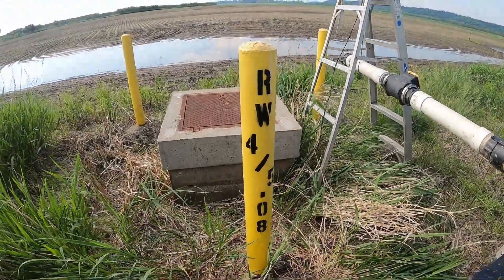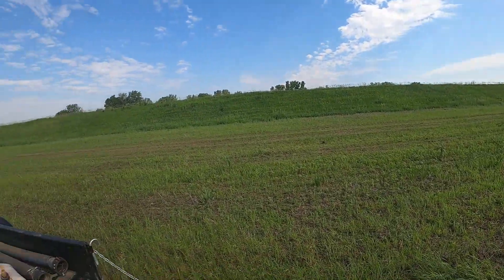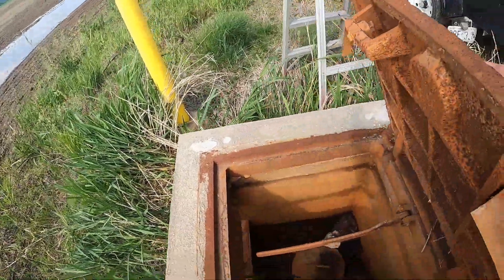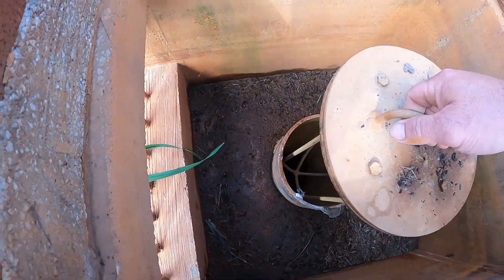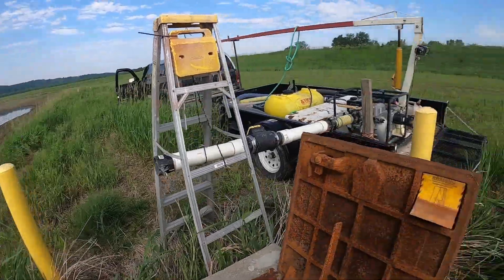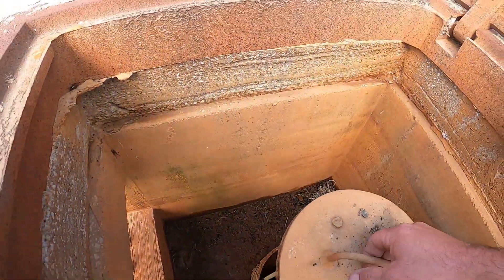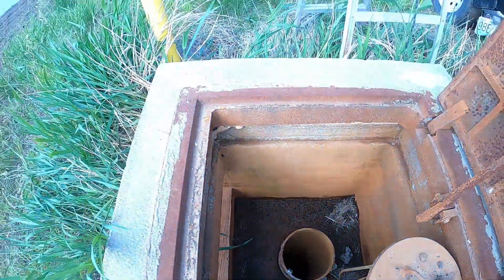There's what's called relief wells. I'm sure you've probably seen them — there's tons of them down through here. I don't know how well you can see them, but we've got 30 or 40 right here on this bend of the river where the levee makes a big corner. What each one of these things does — you open this up and you have a well that sets down in here. As water raises on the inside of the levee it builds pressure, and instead of undermining underneath the levee and finding the weakest spot to get out, they have these wells all drilled so that as the pressure comes up these lids will push up and it lets water come up out of these holes, which are wells usually somewhere between 30 and 50 feet deep. It relieves the pressure so it doesn't undermine underneath the levee.